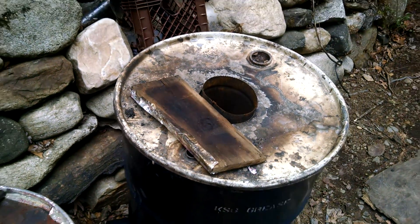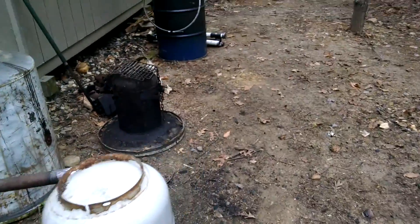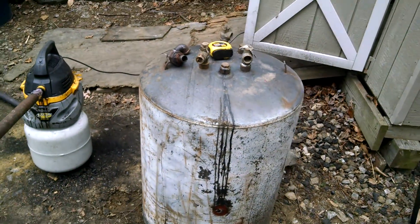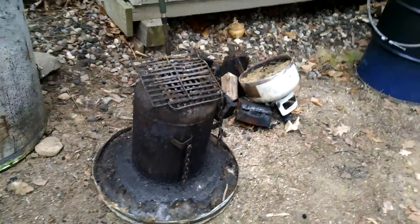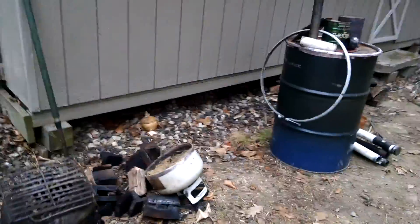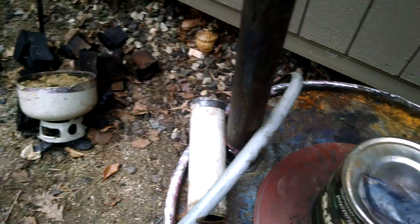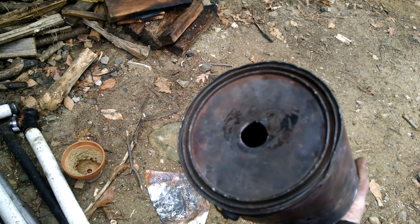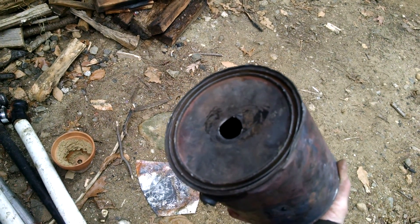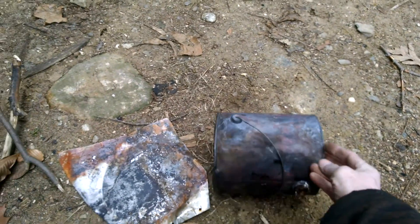This was turned into a rocket stove — I was going to make some charcoal in that, I did that, it didn't work out so hot. This was the first wood gasifier I've ever built, it's upside down, it's the guts to it here. This is another one here. Here's the paint can — I had three little holes in here, I filled it up with wood, put it in the wood stove, and they've made some excellent charcoal. But since then I've cut holes in it so I'm going to get a new one.